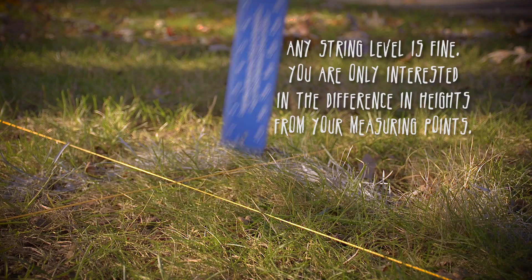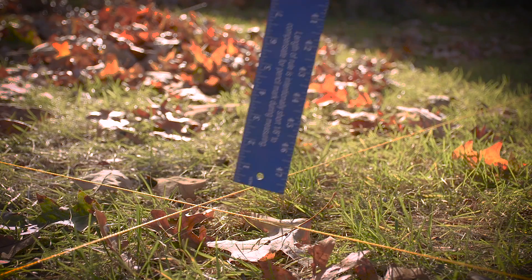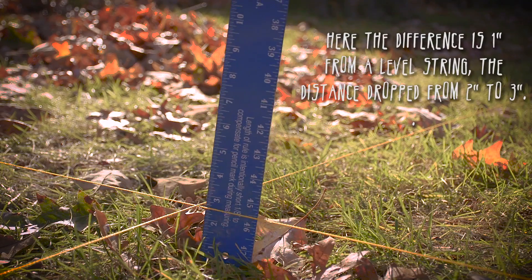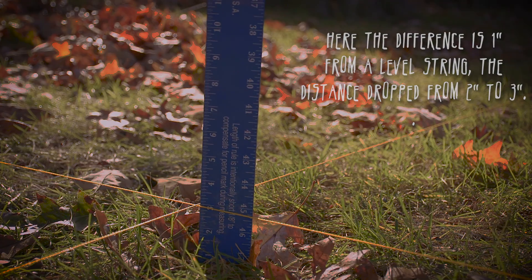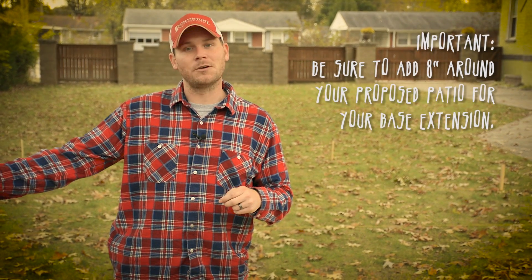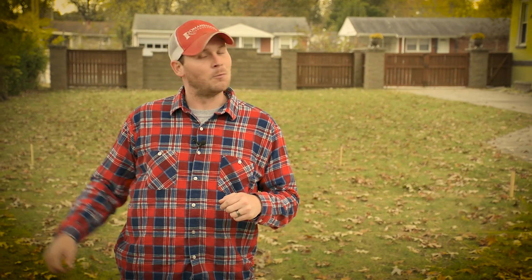If you have more than a couple of inches difference every ten feet, or your lot has drainage issues, now's the time to call a professional. The next step is spray painting our lines for excavation. We'll go just outside our string line to give us plenty of room. We'll mark our spots, pull our strings, and we'll be ready to dig.